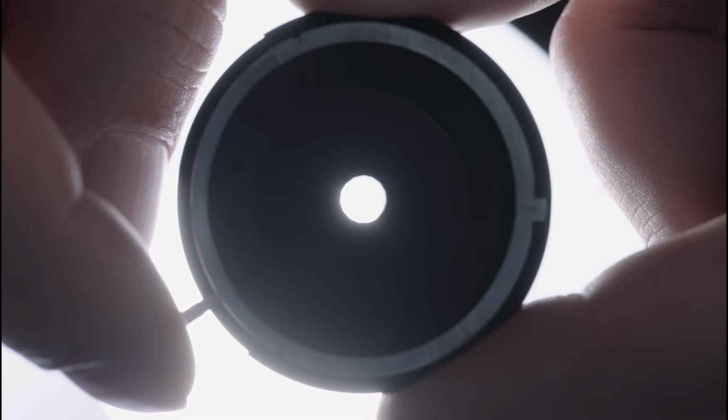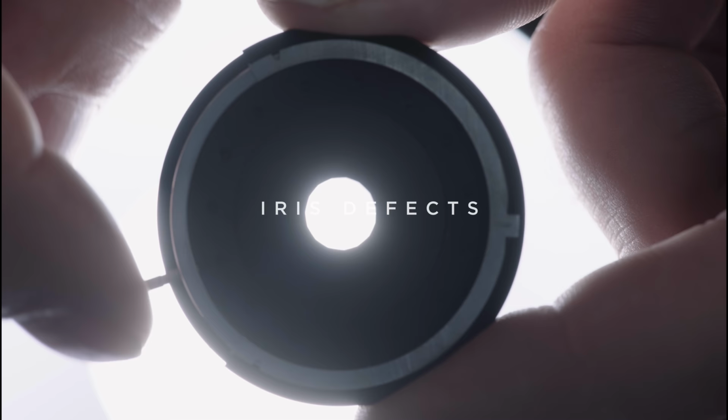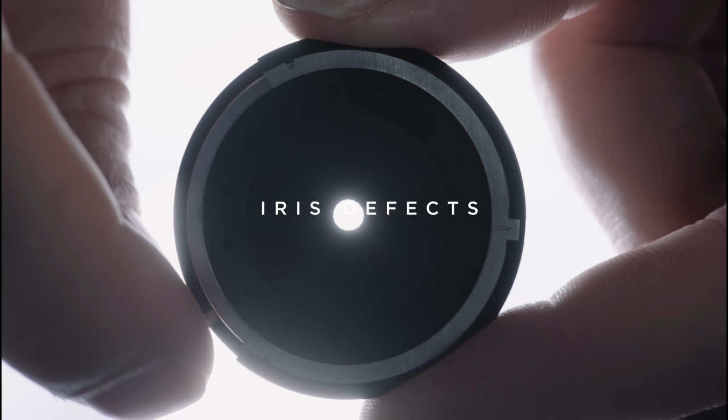An iris can show mechanical defects and can be affected by contaminants. This is only important if the iris is not replaced in the rehousing. Cleaning can potentially damage the iris.